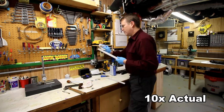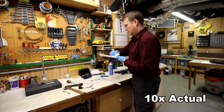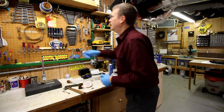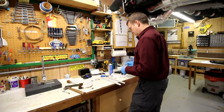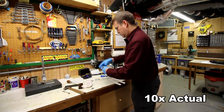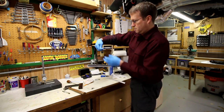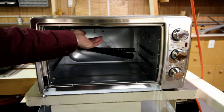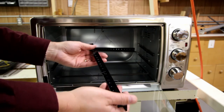It's very important to use acetone to clean everything off and make sure there are no oils left, because that will impede the adhesion of the powder coat. I make a mark when it's finished. Here I'm using 24-gauge galvanized wire — bailing wire — to suspend the parts so I can place them in the oven and hang them from a hook while they're cooking.